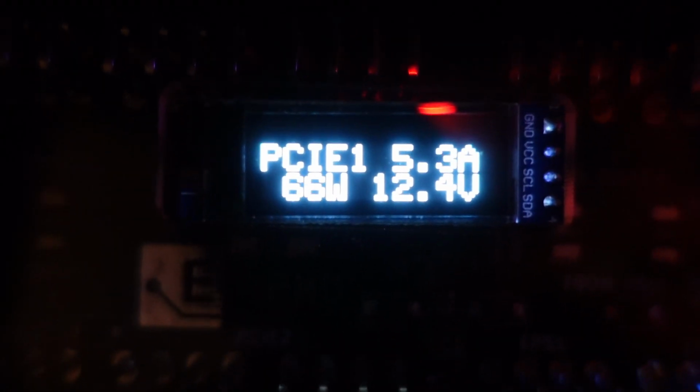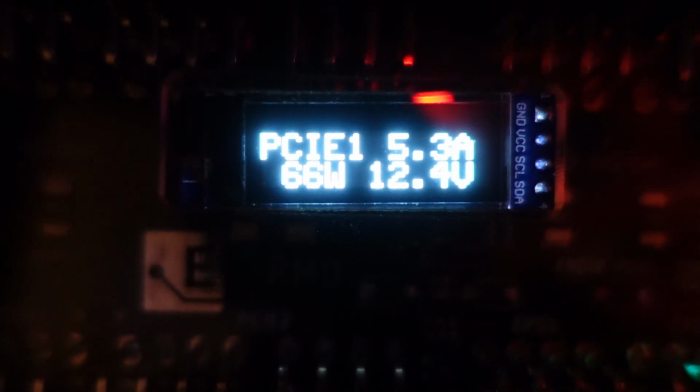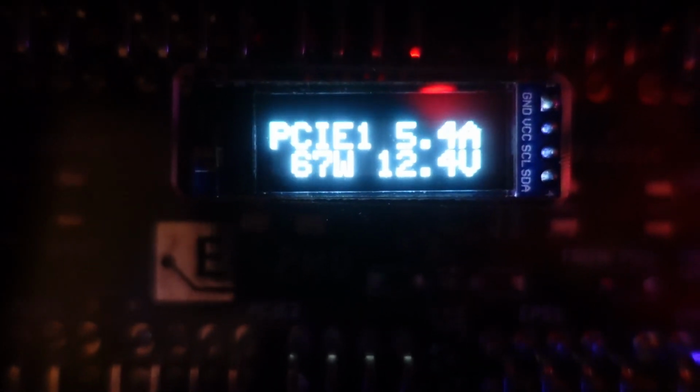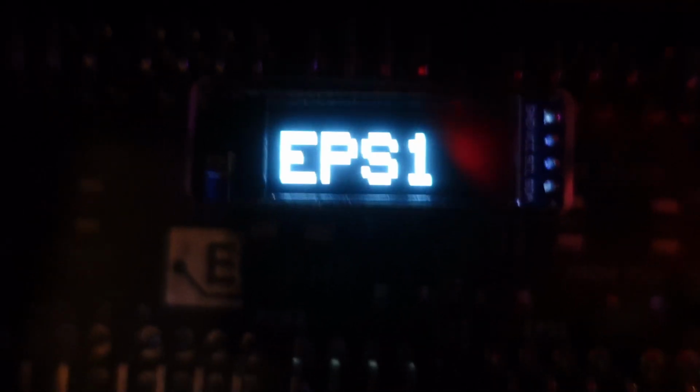Alright, so here's the Elmore Labs PCIe meter, and it looks like it's a lot more biased than those other meters I was using. It's flashing 6 there for a second on the amperage, and I know for a fact that discharger is not getting up to 6 amps. So if it's a full amp off at 6, that means it's 12 watts off. That's a lot.